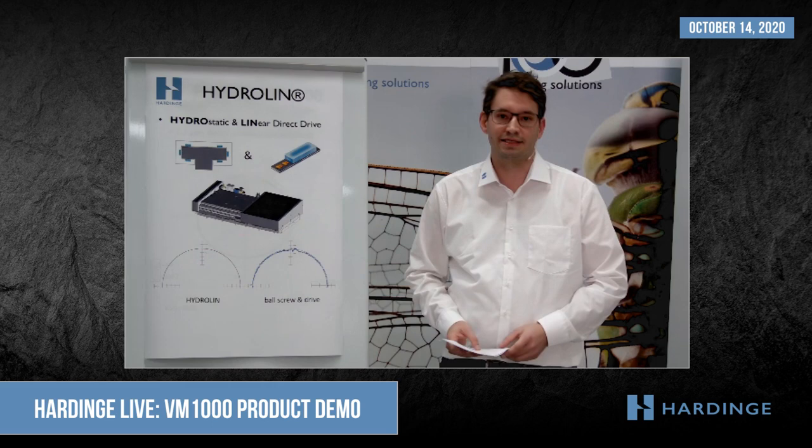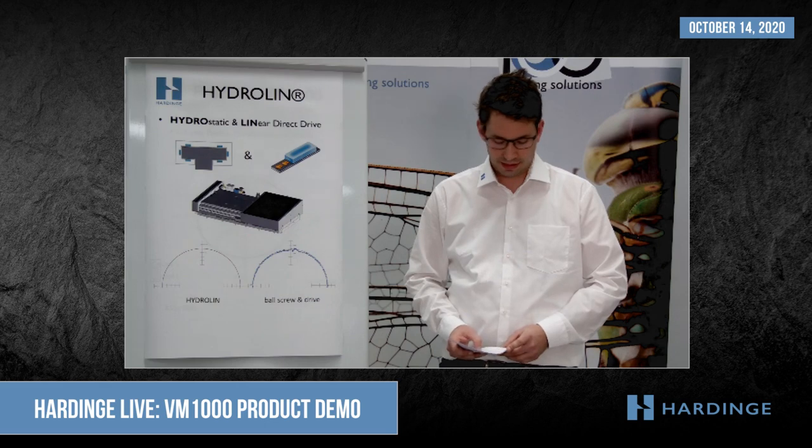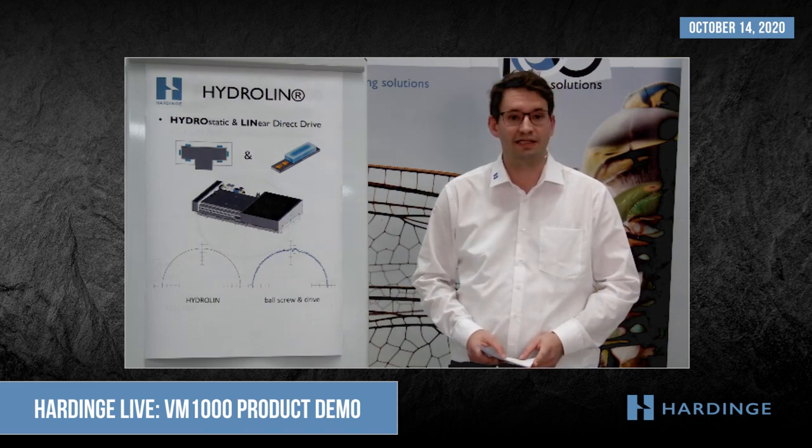A remark to the B axis. Also, the B axes of the VOUMARD 1000 machine are fully hydrostatic with wraparounds together with direct drives. That means that all axes of the VOUMARD 1000 are fully hydrostatic and direct driven with all the advantages. Now back to Patrick. He will explain to you the turret wheel head.